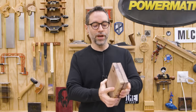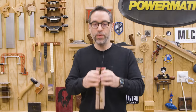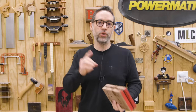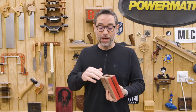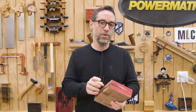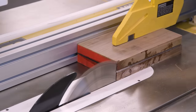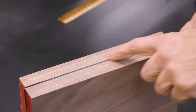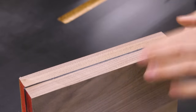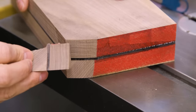This test piece has had an overnight dry time. As far as adhesion goes, I think we're going to be fine — that epoxy is pretty strong stuff. I don't really see any way that we could pull these apart, but we are going to torture the crap out of this thing. I've never really worked with plexiglass in this manner, so I want to make sure it cuts well, that I can hit it with a router bit, see how it sands, hit it with the bandsaw. That went really well — we got some saw marks in there but this would all sand out. No chip out or any real problems. Nice, clean cut even with the bandsaw.